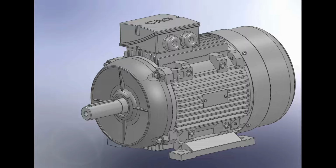Adjustment to load changes involves changes in the angle by which the rotor field lags the stator field and thus involves short-term changes in instantaneous speed. These cause currents to be induced in the damper windings, producing a torque that acts to oppose the speed change. Protection for synchronous motors is similar to that employed with large induction motors. Temperature may be sensed in both the stator and field windings and used to switch off the electric supply. Considerable heating occurs in the rotor damper winding during starting, and a timer is frequently installed to prevent repeated starts within a limited time interval.